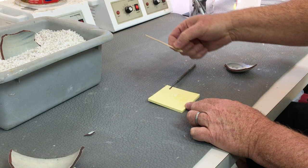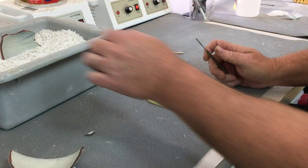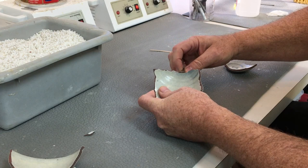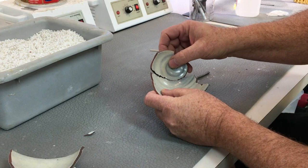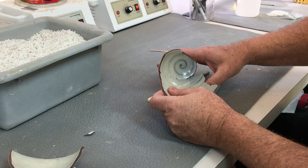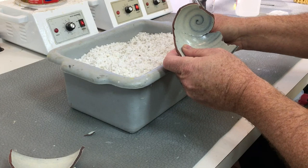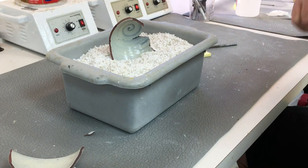After you mix it well in both orientations, you apply the epoxy on the surface that you've determined earlier requires the glue. You apply the pieces together and as you can see some glue squeezed out — don't smear it, it would be very difficult to remove if you smear it, so let it cure that way. Place it in the right orientation and wait 5-10 minutes to harden a bit before placing the new piece.